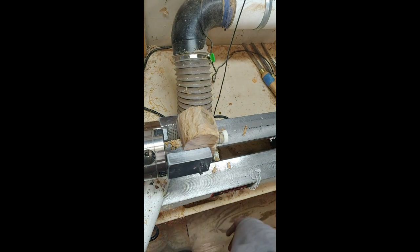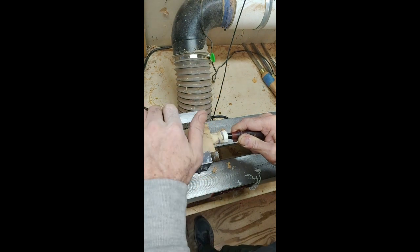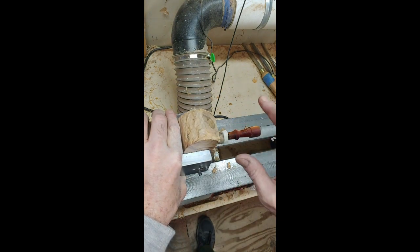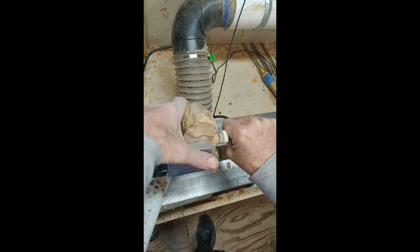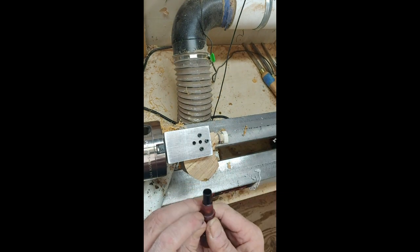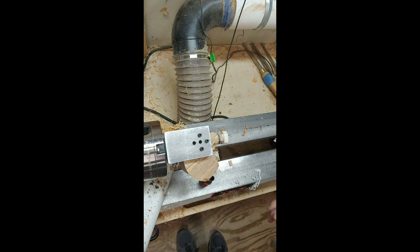All right, so both of these line up. This stem, drum roll. So this is tight. This diameter on these tenons, there's variation in it. That's going to work. That's going to be fine. But I don't want to force that in there. I'm going to take some sandpaper and open this up a little bit. The other thing that I'm going to do is take a countersink bit and drop that a little bit in there, just cut a chamfer on the inside of this opening, and just make it seat a lot neater.